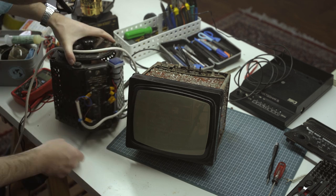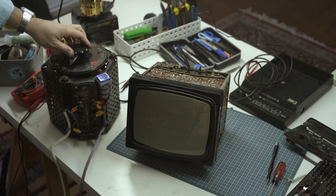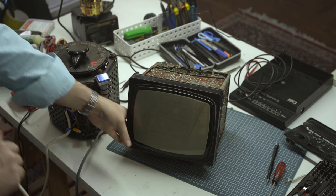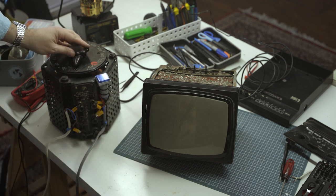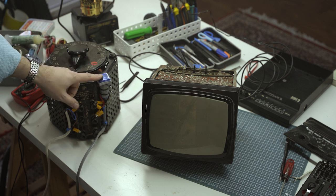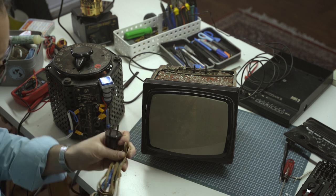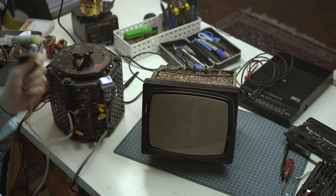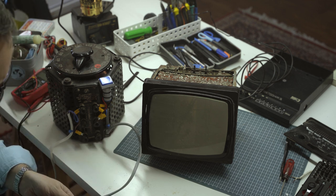This is my Variac — Optimus Prime. We're going to bring the voltage up slow so that if there are any major problems we can dial it back down. I have a digital readout here that more or less matches the numbers on the dial. I've also got some plugs from other Electronica televisions that I think are operational, though a little janky. Hopefully this will work for us.